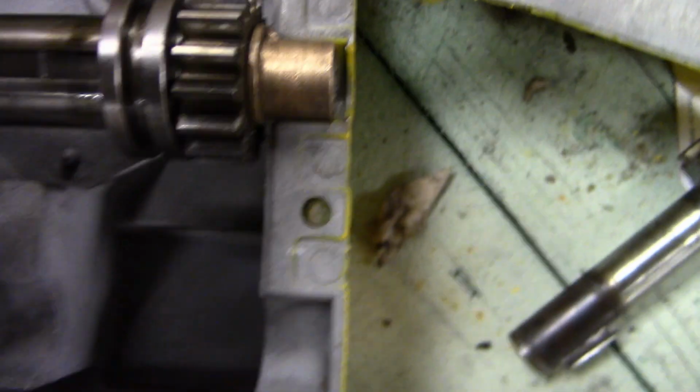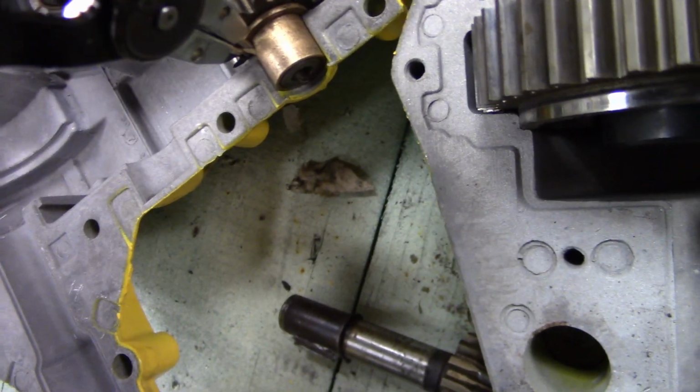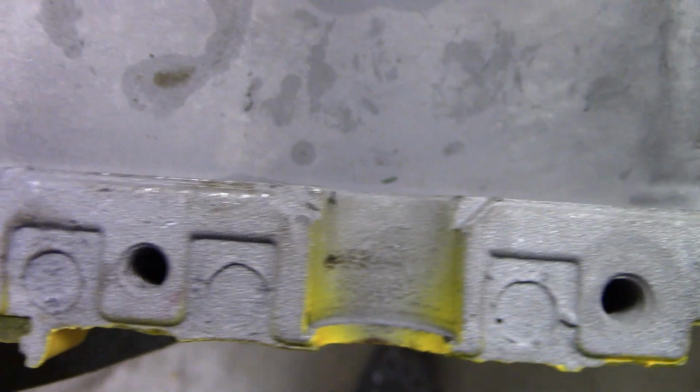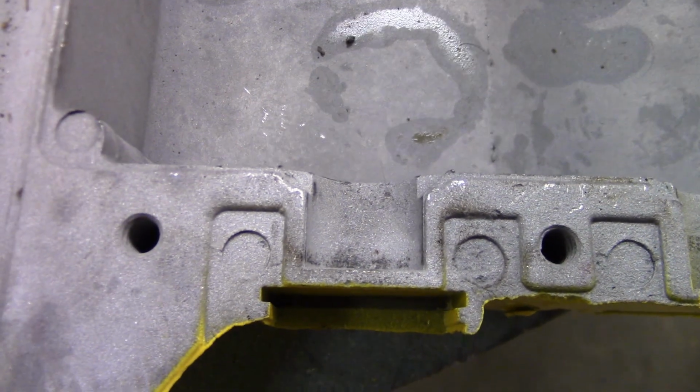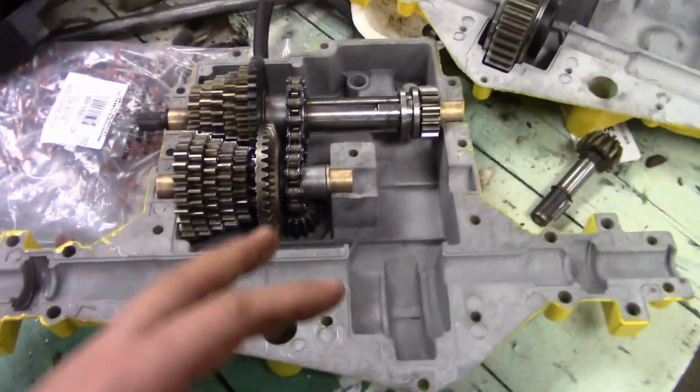And then this one here I need to flip like this. And I usually take something like a screwdriver and just kind of rotate it down like that. But in these cases, there's usually more than just one way you can do it. As you can see, this one you can do both ways. I think on most of them you probably can, but that's how I just like to do it in that pattern. So now I'm gonna put these gears like this. There's the locker.